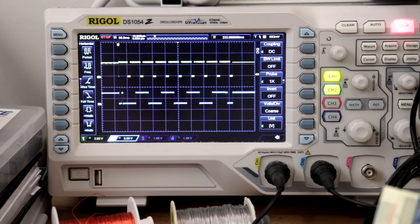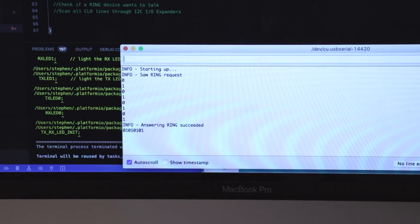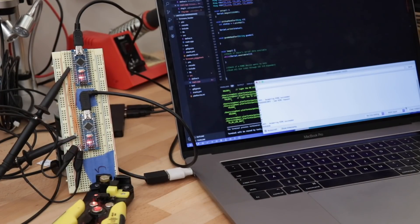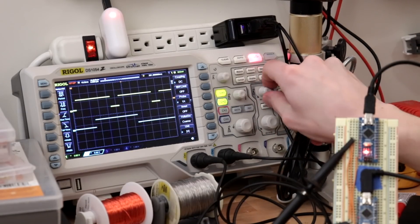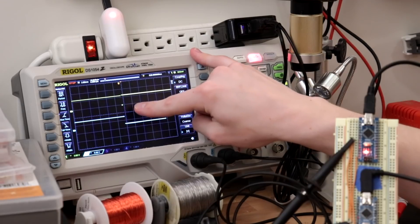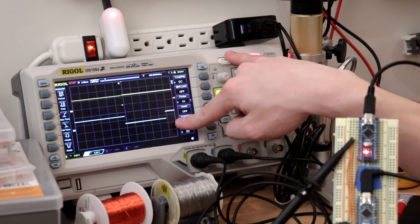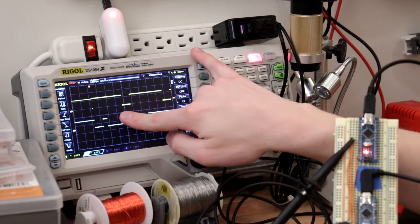And that's it — right there. This is pretty much exactly what I drew on the whiteboard two episodes ago. And there it is on the serial port too! I just sent 0x55 — 0,1,0,1,0,1,0,1 — just to test the highs and lows. Zooming in: the top yellow line is clock and the bottom is data. This tiny yellow blip is the sender saying 'I have a message to send,' and immediately after, because the receiver isn't doing anything, it says 'I hear you, I'm ready,' and pulls that line low, then they both come back up. That's the entire beginning handshake agreeing a message is about to be sent.